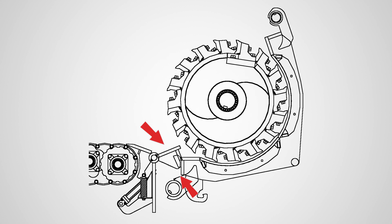Feedstock with lower pliability, like pallets, large diameter round wood, sorted C&D, and wood chips, require lower slab ramp positions.